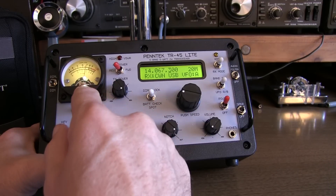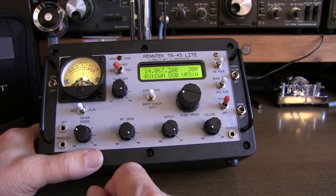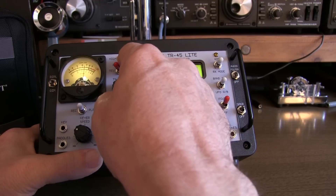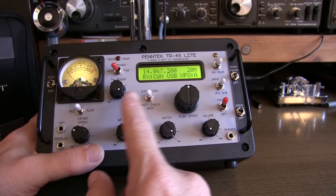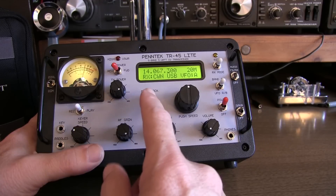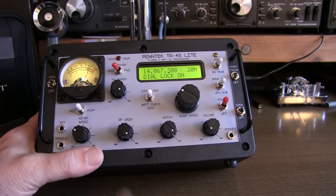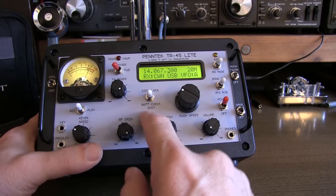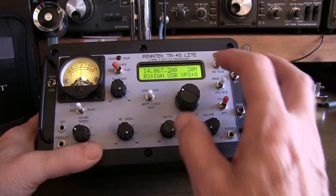When transmitting, the S meter or analog meter can show either forward power or reverse power. We'll typically leave it in reverse power when setting up the tuner, just to ensure I can see what's happening if something goes wrong with the antenna. There's also a high SWR warning light — once the reflected power gets too high, that will light up and give you an indication to check your antenna or readjust the tuner. A couple of the switches are momentary push buttons with a center-off position. Toggling one up activates a dial lock so you won't accidentally change frequencies. Pushing it down performs a battery check on the meter. There's also a spot function so you can hear your side tone and compare it to the station you're listening to, to verify you're properly zero-beat.